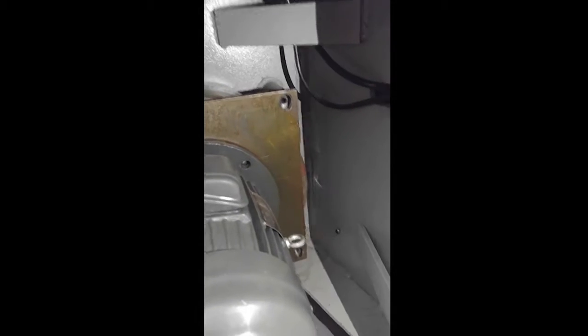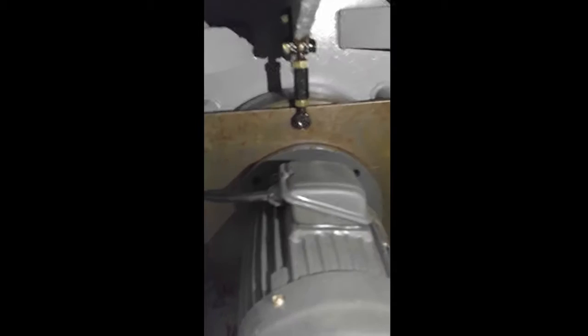Once the cover has been removed, the next thing you'll need to do is remove the 4 bolts for the motor right there. And those are what size, Chris? 10 millimeter. These are 10 millimeter. And then last, you'll be removing 4 of these bolts. These are 12 millimeter, one on each corner.